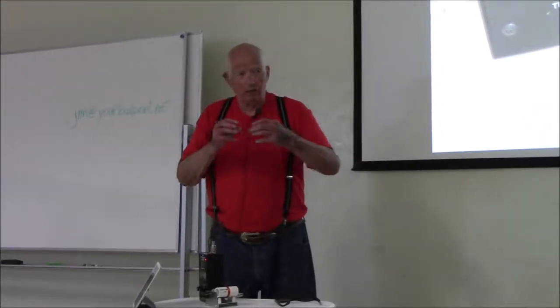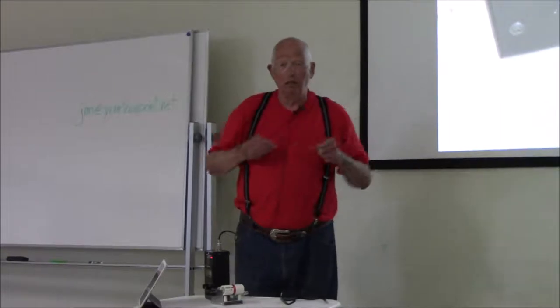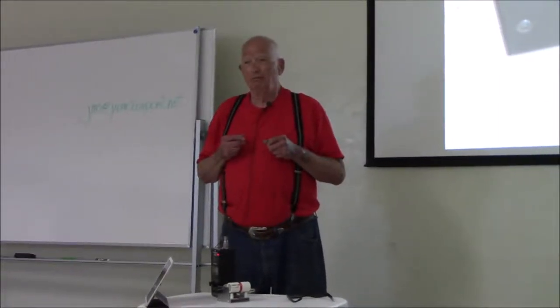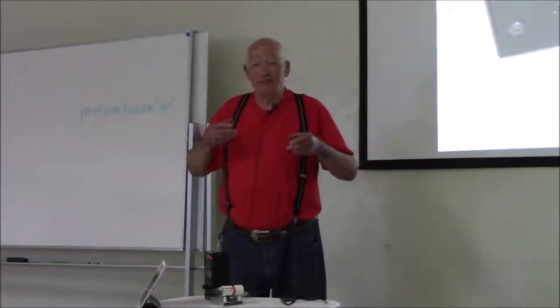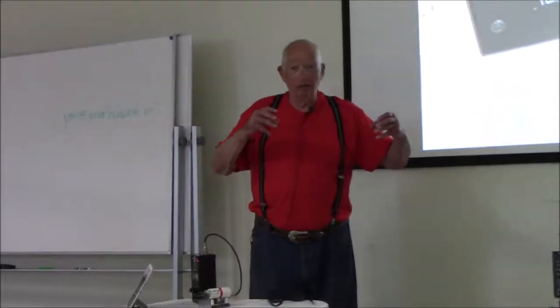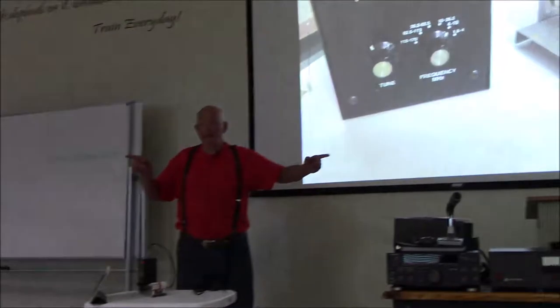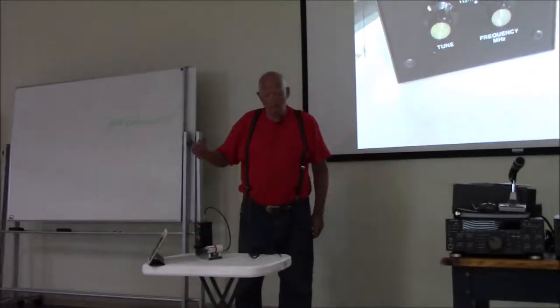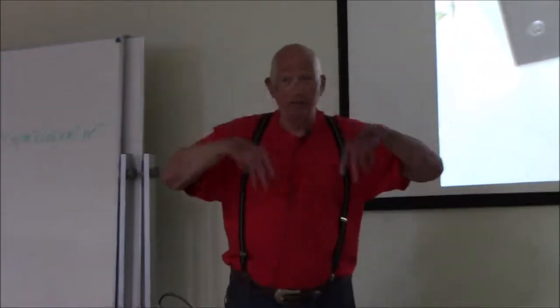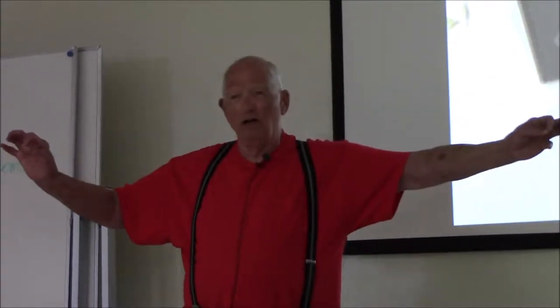Well, we talked about a conductor, a wire, and we ran current through the wire, and it generated a magnetic field. Now, what's a magnetic field? Who knows? It's a phenomenon we can detect. We're not sure what it is, and unfortunately, that's the truth. But we know that if you create a changing magnetic field and you put a wire in it, a voltage appears across the ends of the wire. Well, it's a generator. Or if I run a current through a wire, it generates a magnetic field that expands out into space around that wire. And as soon as the current goes away, it collapses and makes a great big high voltage on the wire for just a second.